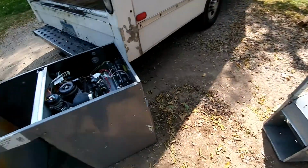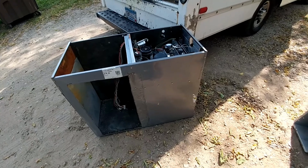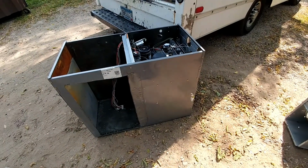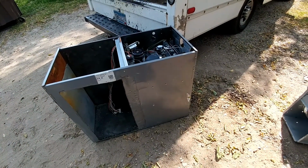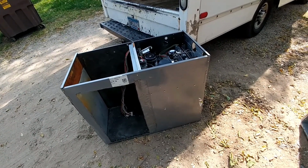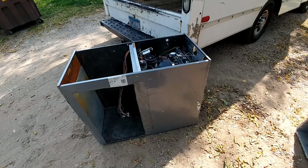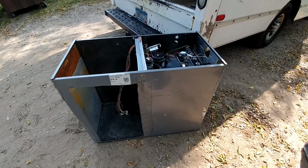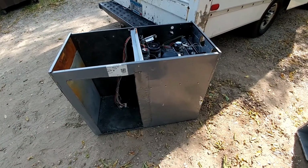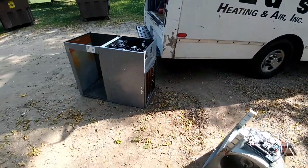The new one is an N95 that took the place of the G9 MVT. Well, no, that's not true. This is a variable speed. The N95 is the single stage version of this, which is the one we put in today. And then you've got the G9, I can't remember the variable speed model number. Don't sell it that often, but if you have zoning, I'm going to be calling out that furnace for you, because I'm going to want you to go 2-stage. This is a 2-stage variable. Anyway, that's what you need to know about this furnace.